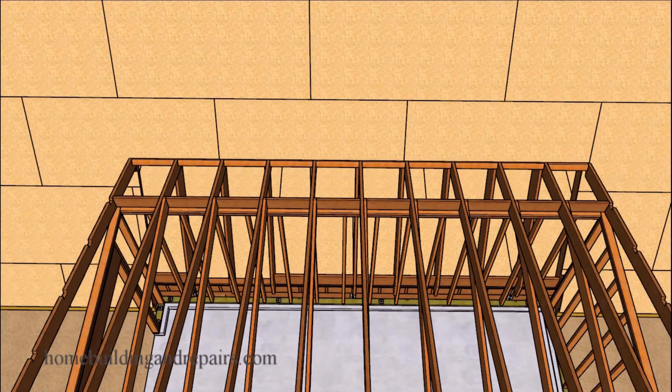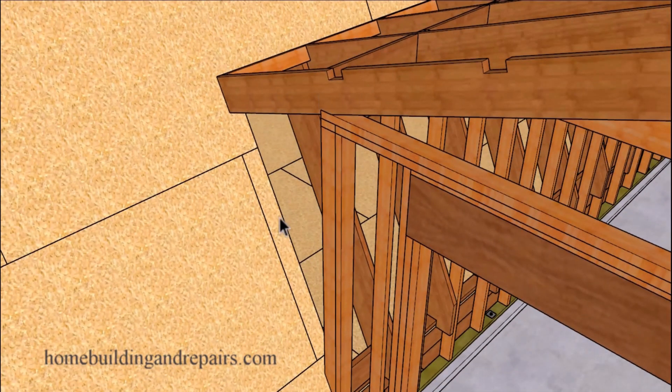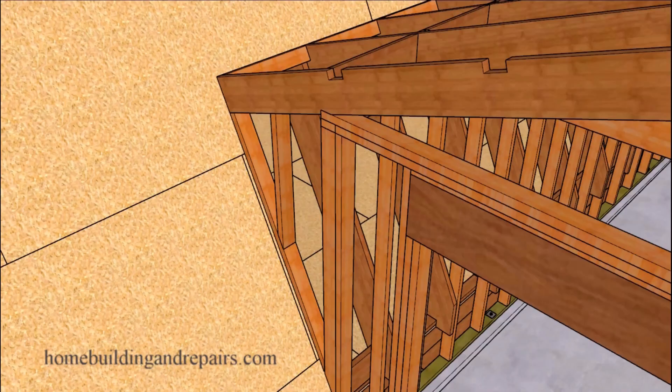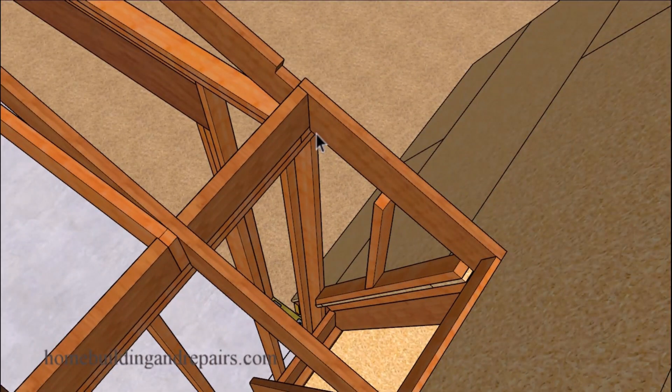Let's go ahead and install our roof sheathing. We are going to extend the sheathing over a little bit so that we can install our wall here — I like to have my wall sit on top of the sheathing. You could also set the lower framing plate on top of the backing or the roof rafters, and you could install some additional support backing up here too. You can attach a two-by-four to the bottom of the rafter if you're looking for a little more nailing at the upper section of the framing studs.